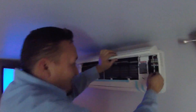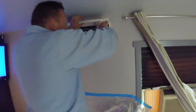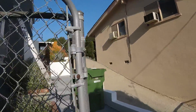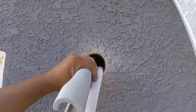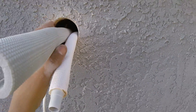Here's my expert HVAC technician Milo — he's wiring up the ductless mini split. I actually forgot to pop the drain out, so I had to pull the unit back out. Now the drain is out, and I'm going to make sure that it's got pitch.